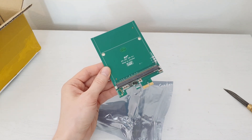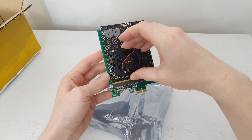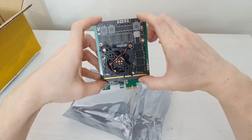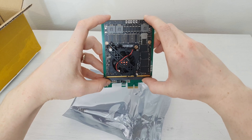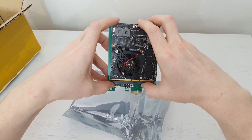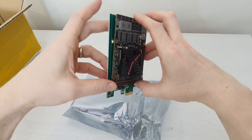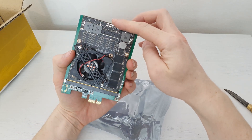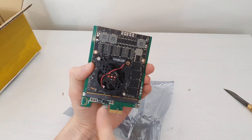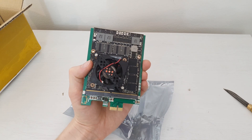So I have got an MXM card like this one — it's going to be interesting to test. This is actually an official Nvidia card so I will have to figure out how to modify the drivers for it. I didn't have any cooler for it so I sticky-taped a little AMD cooler from an old AMD graphics card. That will do for testing — of course in a real project I'll need decent cooling. I'll keep you updated how it goes, because this card has the same GPU as the Nvidia GTX 1060 but it's only 4GB of RAM and the default drivers are not working with it.